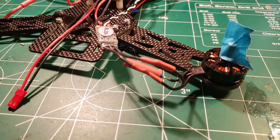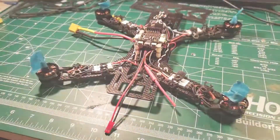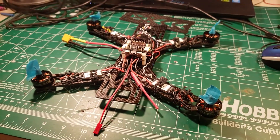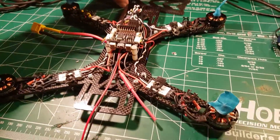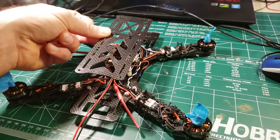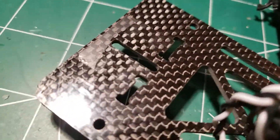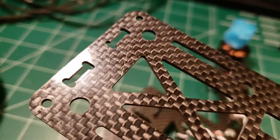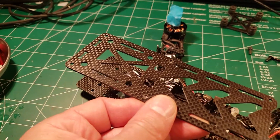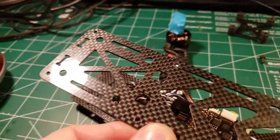I'll finish up with all the rest using two hands. Next I'm going to tidy things up a bit - it's quite messy. Keep in mind tidying up a PWM build with all those wires is a little more difficult than other methods. I feel ready to put the hood on. Beginner's tip: see those two little notches on the top plate? They correspond with two little notches on the frame - that's the front of your quad. Those four notches support the vertical plate that holds your FPV camera. Don't accidentally flip it around or attach it to the back - that's somewhere we've all been before.